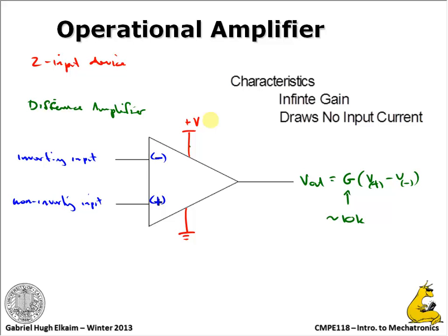And we'll use them in this class at either plus 5 volts. Some of them go up to 18 volts, 20 volts. The one we've given you a bunch of goes up to 6 volts, so above that it will get unhappy. So plus 5 is a good place to run them at, or 3.3. That one will, in fact, work all the way down to, I think, 1.8 volts. So it'll work quite well.